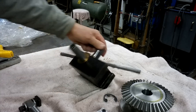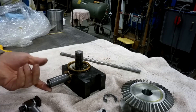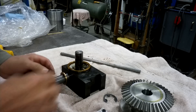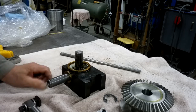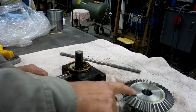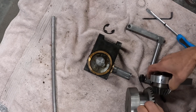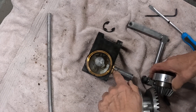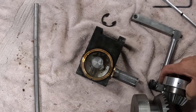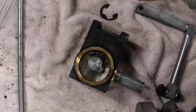So there's the main body. That's as far as I can disassemble it. This is pressed in. This is pressed in. This bushing here is one of the mating bushings, so that these two gears meshed together with just the right amount of clearance. I made this spacer and this spacer to take up for the slack in the teeth, in the meshing of the teeth.